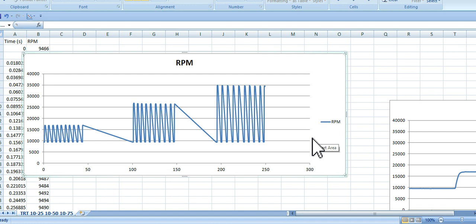Then one of the other things we considered is how do you not penalize motors that, for example, are a higher kV or a taller stator motor. Pretend that these are different motors instead of the same one, but what if one motor only jumps a little bit versus another motor, and this motor takes a little bit longer? Do you really want to penalize this motor versus the motor with the narrow response? Initially we're looking at response time, so how long does the motor take to go from the baseline up to the upper throttle point? But we didn't want to penalize the higher performing motors, the ones that had the bigger jumps. So what I ultimately wanted to look at was the response rate, effectively the slope of this jump.